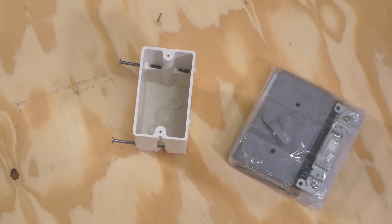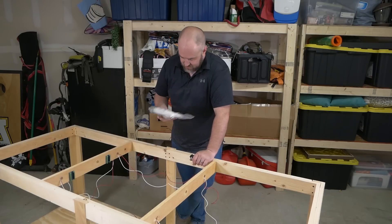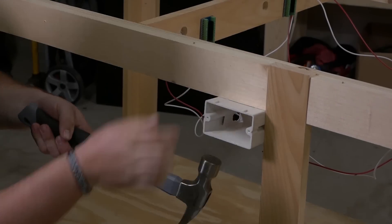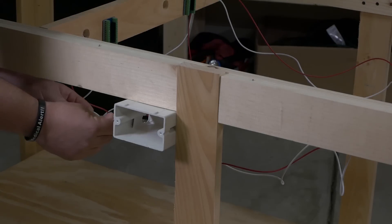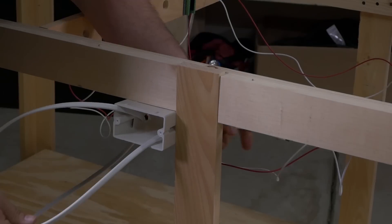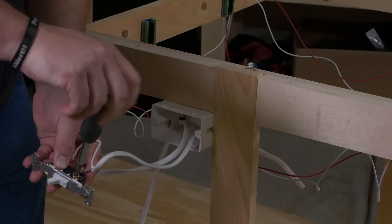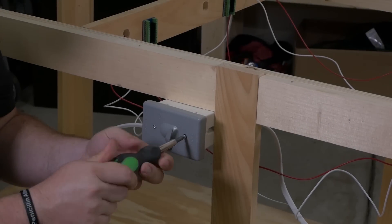I went around Home Depot and found this light switch cover that kind of looks like a master big on-off switch, and I want to wire that into my layout to be the master power. So I grabbed some 14-gauge grounded wire and some DIY plug adapters, and we're going to make that happen. I started by attaching the box for the switch — it's a common switch, the same kind you can find in your walls for all the light switches and plugs in your house. After punching a couple of holes in it, I ran the 14-gauge wire through, then stripped the wire to reveal the three wires underneath and cut the black wire. I stripped both sides of the cut and attached the stripped ends to the light switch, then screwed the switch into the box and attached the super cool cover.